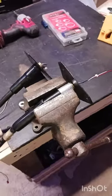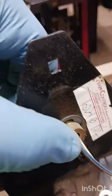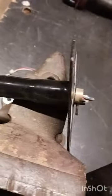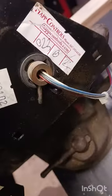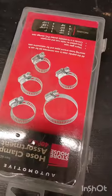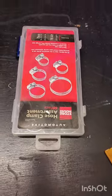I pulled the guns out and got them here on the workbench. As you can see on this one, it has what's known as a C-ring or snap ring — you pop that off, which is what they unfortunately did on this other one, and the cable comes out in case you need to work on it. Sometimes you have to replace these cables when they get damaged, kinked, or have cut wires. We don't have a ten-cent snap ring, so that's going to be on my list to get. What we do have is some hose clamps and a washer that fits over the top of this.